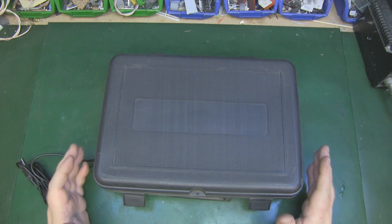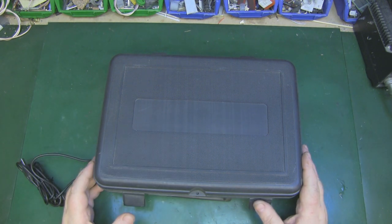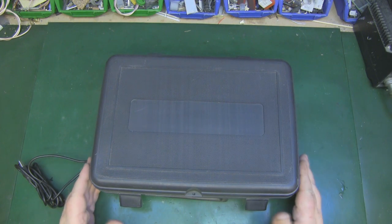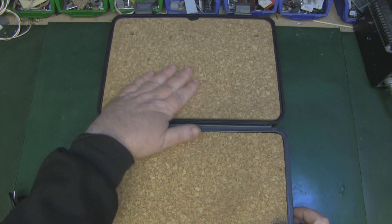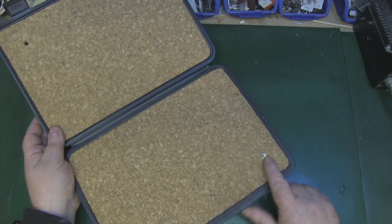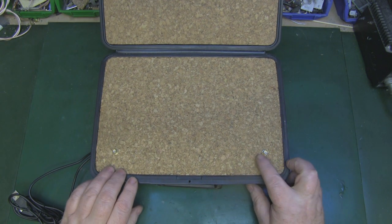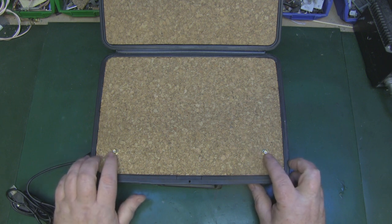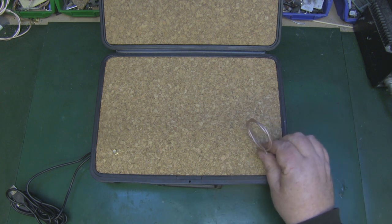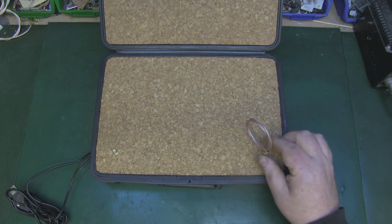To speed up testing, rather than testing each one individually — screwing on an alpha card and screwing it back off again and repeating that over and over — I got this old box. It had a knock-off Dremel tool inside it. I've lined it with cork, and there are two holes at the top that fit over two SMA connectors. These are bulkhead SMA connectors and I ground off all the threads so that I can just stick a connector over the top — it makes the connection with the center pin and still makes a good ground connection.